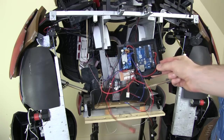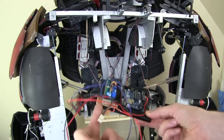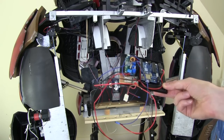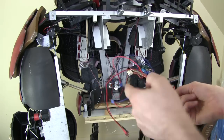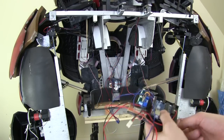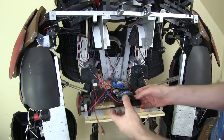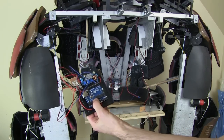So there's the first Arduino, its regulator and the ULN2803 Darlington Array. And here's another one — exactly the same but with a slightly different regulator, another Uno and another ULN2803. This is going to run a whole other sequence so I can essentially parallel process and multitask. These go off to servos that are in the front panel. I've got another connector here to go to the helmet for the NeoPixels in the eyes, and we're also going to run the lights which are in the front chest panel. Both of the Arduinos will be controlled from the Photon, which means I can trigger the functions from a smartphone.